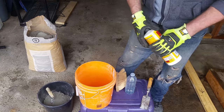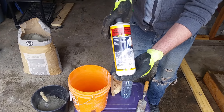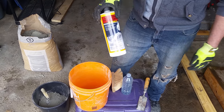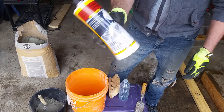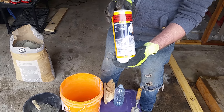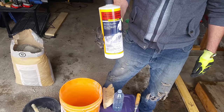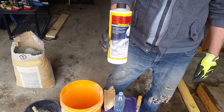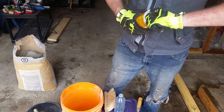In this instance I'm going to be using an acrylic fortifier. This product is going to be beneficial because this concrete bonding application is going to be for an underwater application, and as a result I'm going to need something that can stand up to hydrostatic pressure. This bonding agent is the thin one — like milk — as opposed to the thick one like a white glue. The white glue one is very easy to use and user-friendly; it's called the universal bonding agent. But if you're going to be doing something exposed to constant water, the thicker white glue product is not ideal. You want to go with an acrylic latex product.